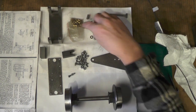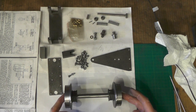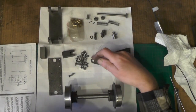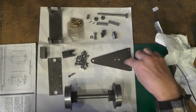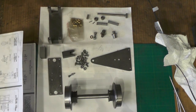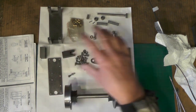I've got my oil nipples for my end feed oil system on my axle. Just before I go though, I will point one thing out: if you are making the metre gauge version, when you're doing the radius plate you've got to allow for the different wheel centres. So this has to be shortened to the relevant size, and there's no drawing for that — I just took the measurement off the loco — so that's something to be aware of if you're making the metre gauge. I'm going to call it a day for today, and I'll catch you on the next video when I'm assembling all this together.